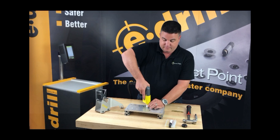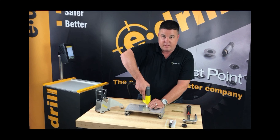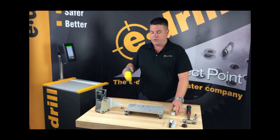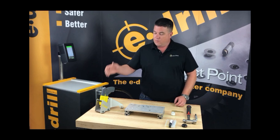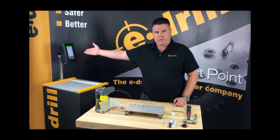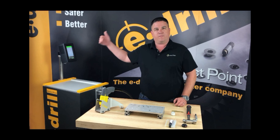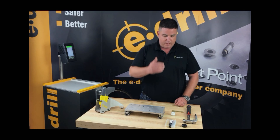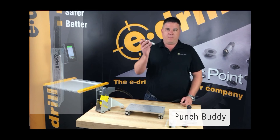There is a little bit of spring, and you're going to depress through the spring, then actuate the cut. It's very important that while you're making a cut you hold the gun extremely still. It should only be about 10 to 12 seconds — the onboard actuator is detecting how deep the electrode is bored into the fastener. Once completed, you'll get an indicator light on the back corresponding to a display message saying either the cut was good or out of parameters. This cut was complete within all parameters, so we're good to go.